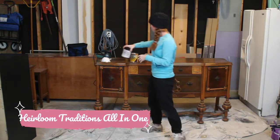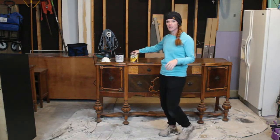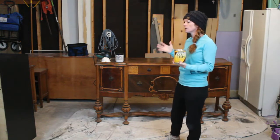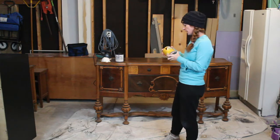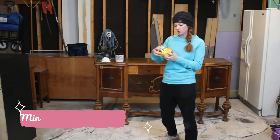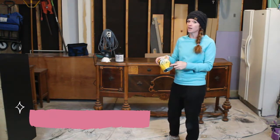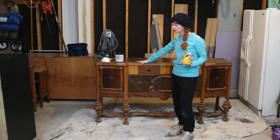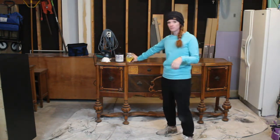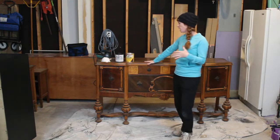There are several different kinds out there but the kind I use is Heirloom Traditions, and today I'm going to be using the linen color. I'm also going to be scuff sanding the top and using a gel stain, which I love because it's just so much easier than staining and it's not as messy. I use Minwax gel stain — you can get this at Home Depot or Ace or anywhere — and I'm going to be using the walnut color because it's just a little bit darker than what I already have.